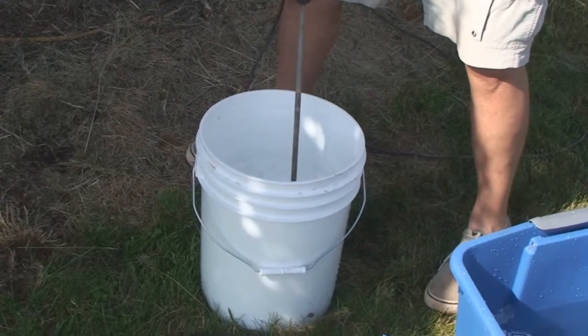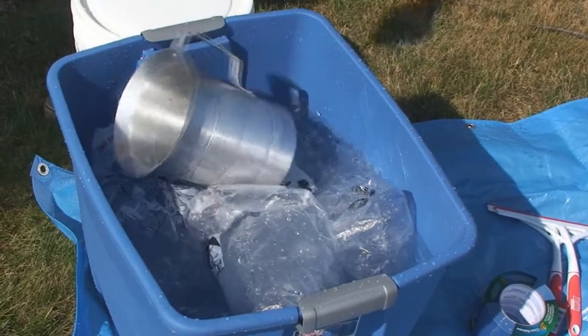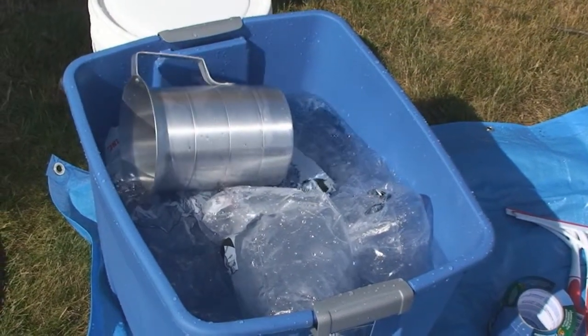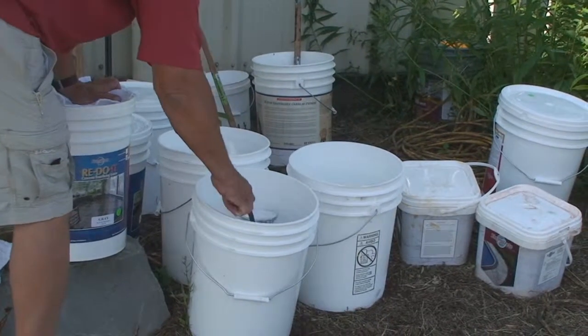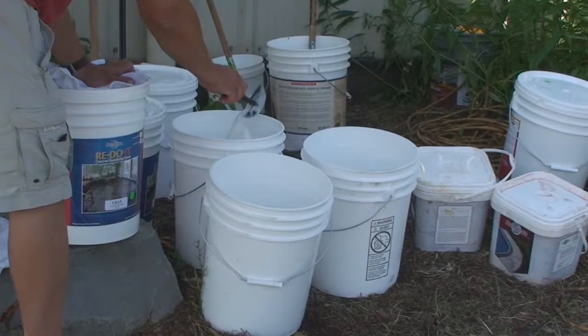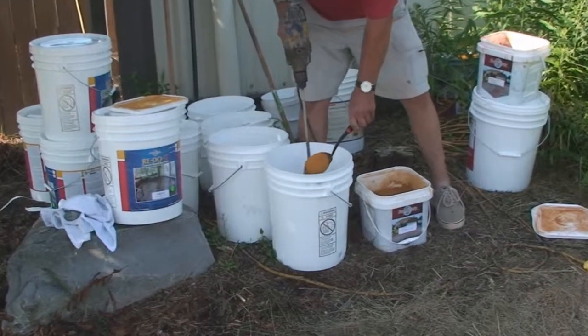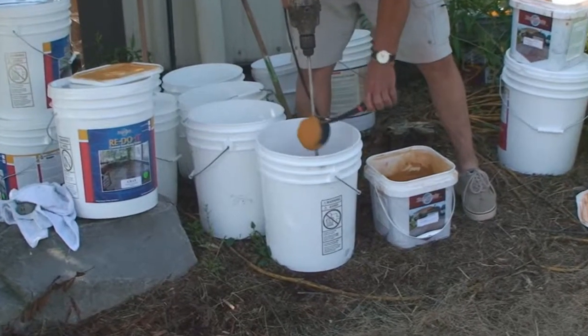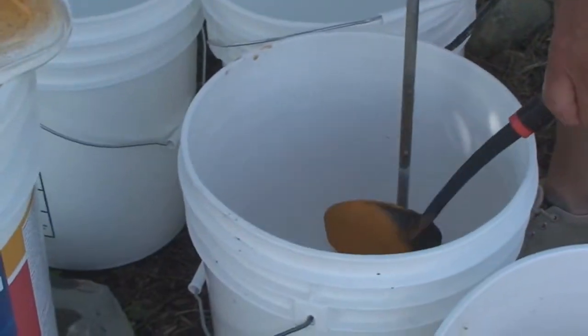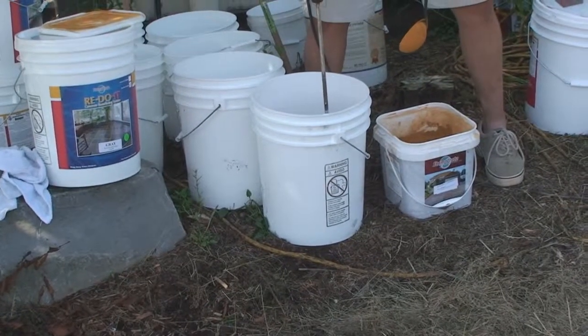Our successful contractors all say, work out of direct sunlight, and if you can't find shade, make it. Now with 1 gallon of the cold water in each of our 6 mixing pails, we're adding in a scoop of primer, further assurance of a good bond. Next, add the color to the liquid and mix it first with the cone mixer. Mix at least 2 minutes to make sure the pigment is thoroughly blended.